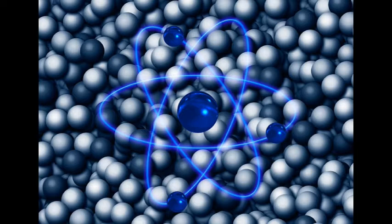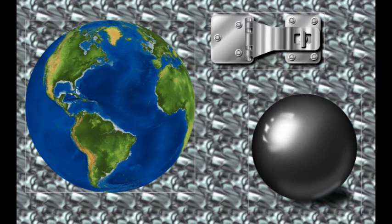Well, electrical ground is a theoretically infinite reservoir of freely movable positive and negative electric charges, so large in numbers that it doesn't have any consequence when I take electrons away from it or put electrons into it. And that's the reason why the electrical potential of ground is always 0. And what is it made from? Well, for example, the Earth is such an electrical ground, or a larger piece of metal. There are even ways to generate ground electronically.